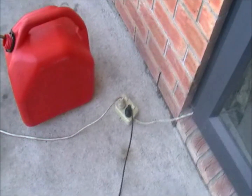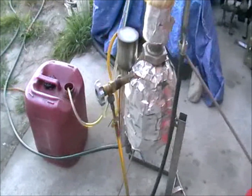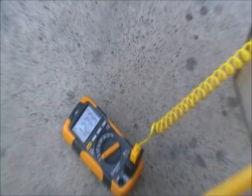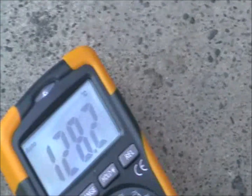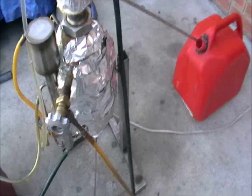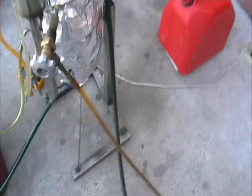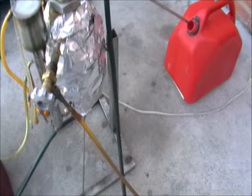Without switching the pump off, you start your heater — this is the first step. We've switched on the electricity supply, the system is primed, and the control valve is still shut. Temperature is already at 128. With these systems, when you're processing oil, the actual temperature control is more like an observation of the temperature without a high relation to the actual work of the system itself.